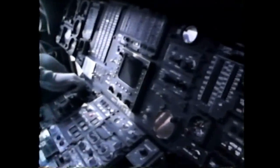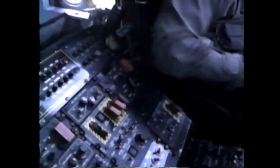Underwater emergency egress from the H-60 requires some unique precautions. Since secondary egress from the cockpit is very difficult, pilot and co-pilot must ensure they jettison their entire doors prior to ditching. And they must move armor plating out of their escape path.